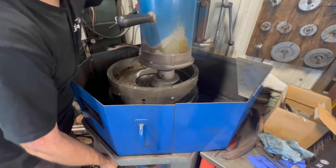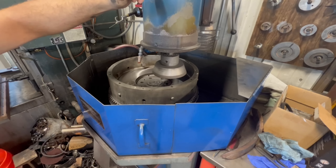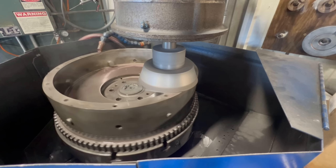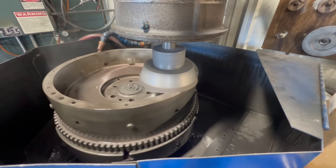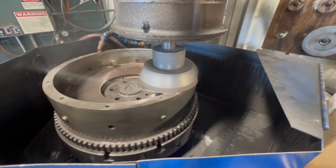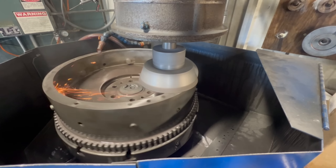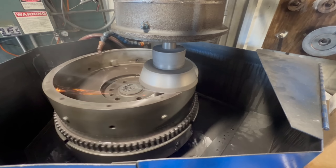The machine does have a power feed to raise and lower the column, but unfortunately ours needs a bit of work so we have to help it along with the manual feed wheel in order to raise the grinding wheel. At this point we reposition the grinding wheel over the upper step of the flywheel and begin the grinding process on this surface. This surface won't have the same wear as the lower surface from the clutch, but an equal amount of material must be removed in order to get the two steps the correct specified distance from each other. I like to begin by taking a bit of material off the upper surface to ensure it is flat and true before measuring our step to get an exact measurement of how much more material needs to be removed.